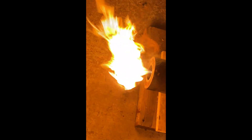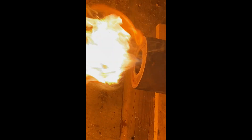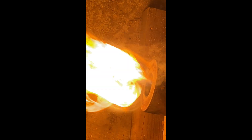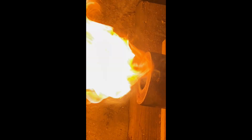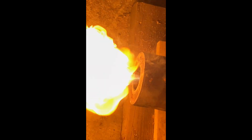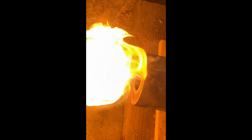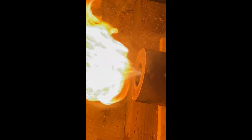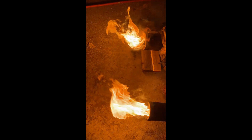Now let's take a look at the conventional burner. You can see it goes out quite a ways before the flame even starts, and it's also a wider flame. We used to call that the sunflower burner because it would kind of spread out like a flower. The problem with this burner is it gets too much air into the flow up there, and the flame is actually quite a bit cooler than the flame retention head burner. You need more of that flame concentrated together, like the flame retention head does.